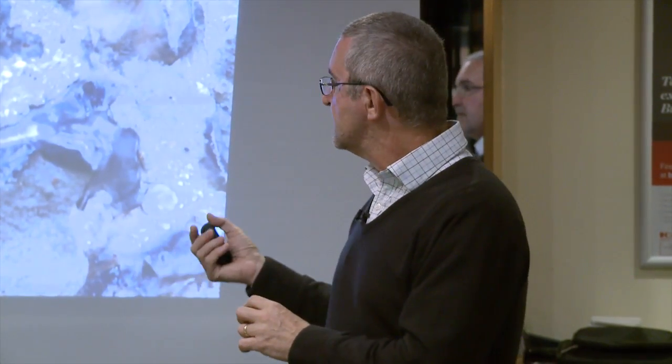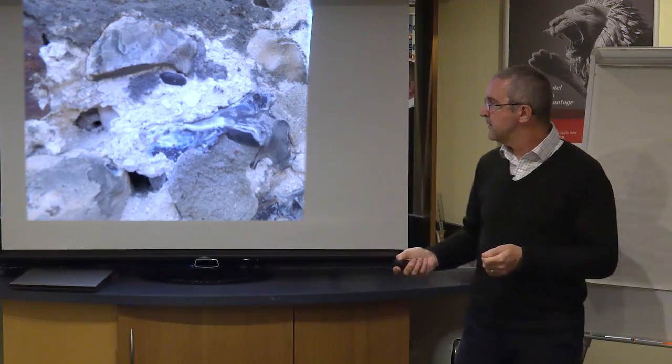lime. And so as soon as someone sees that, they'll be saying, yeah, okay, you can have your lime mortar, but it's got to be a hot lime. So the contractor who's mixing it must know what he's doing. You can't buy this in a container or whatever. You've got to be familiar and know how to mix it. And it gives the wall a nice pleasant appearance.